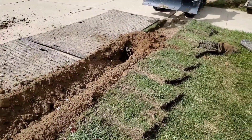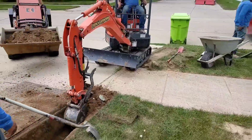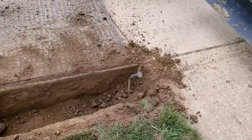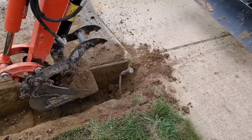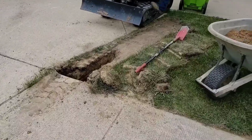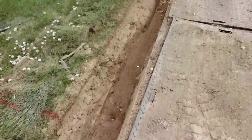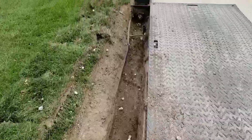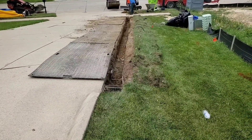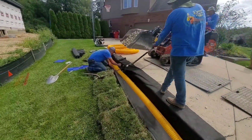This styrofoam french drain just went down to a pop-up, and we're going to do the same thing - take it down to a pop-up. Our pop-up is going to have a turf restrictor plate to keep the grass from growing over the end. A pop-up is the weapon of choice, but the problem is grass grows over a four-inch pop-up so quickly you blink and you don't even know where it is. The guys elected to keep that basin in place, and we went ahead with the six-inch pipe.